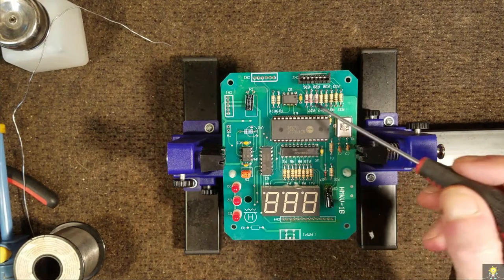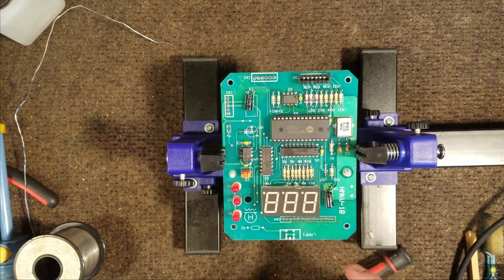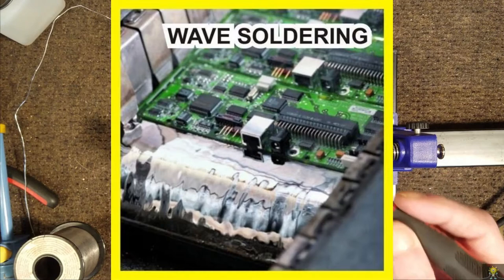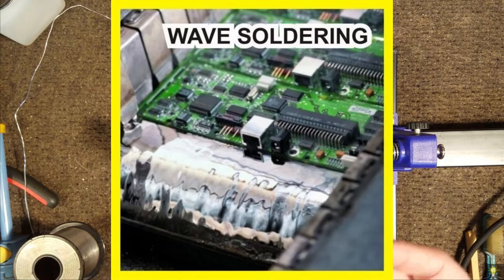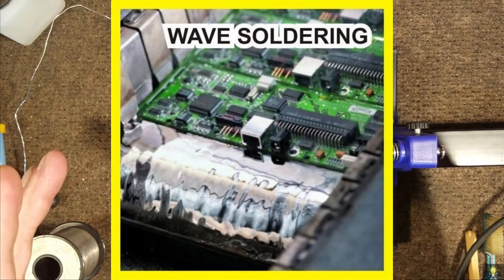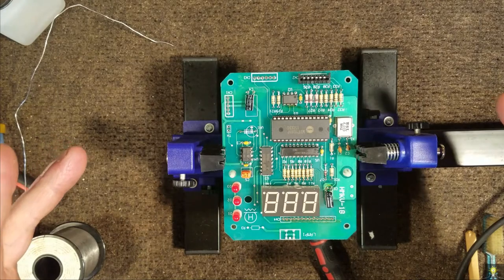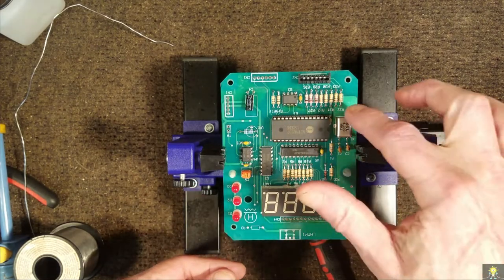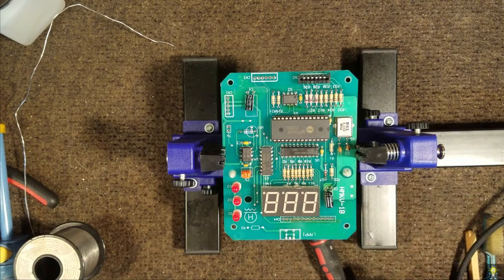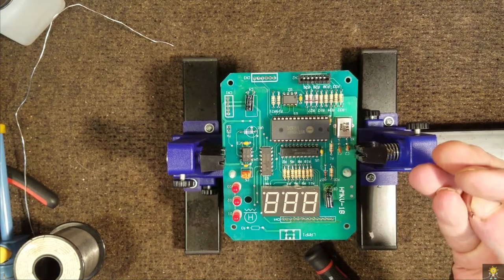To me, it looked like the solder that was on here, I call old solder. When the board is put through the solder bath, the solder that is in the pool has been heated so long that it doesn't really affix to the copper clad and the components. It kind of crystallizes. Because when I was soldering this, I could see that solder pull hard and then melt.